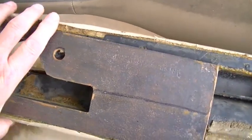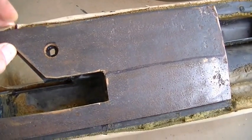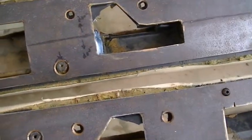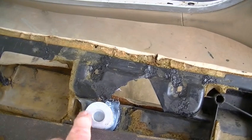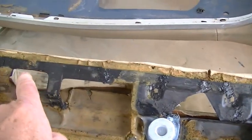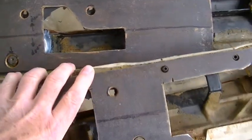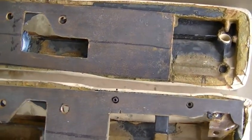It has good adhesion properties, and it will hold this metal to the plastic, so it's conformed to hit here and hit down here. Okay, so I put the bend through there to make it conformed, and I put the washers right here, built it up, so it gives another surface to silicone across here, and across the bottom, and across the top. And that should be enough to hold it in place. Okay, both of those will be siliconed in like that. It'll reinforce that plastic that I welded together.